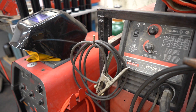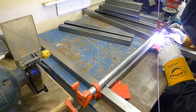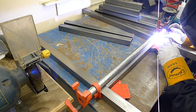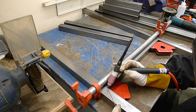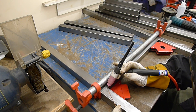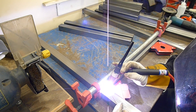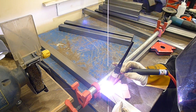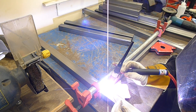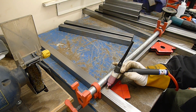After quite a few years of MIG welding, I bought myself a TIG welder. It gives me more control, more material flexibility, and way more precision, but it requires a lot more skill. Fundamentally though, it's really all about controlling a molten puddle of metal, adding the appropriate amount of filler, and letting it cool. Lots of folks will say gas welding is really the way to learn, but I disagree — I think gas welding is a little old fashioned, and while it's incredibly useful and versatile, MIG is a lot easier to get started on.